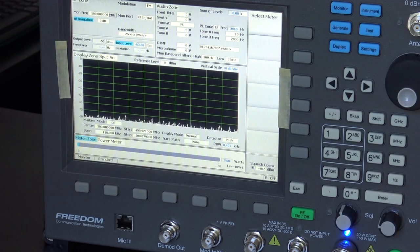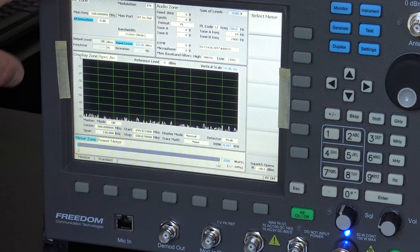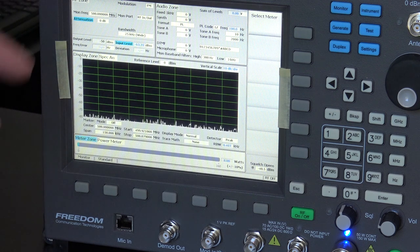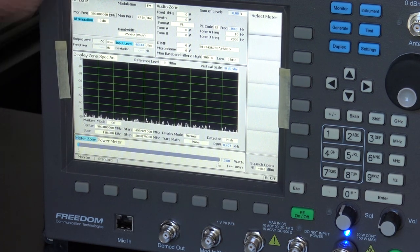That's into the dummy load built into the service monitor — you can transmit up to 150 watts across a wide frequency range. It's reading 3.17, 3.2 watts. So it's not a five-watt radio. A lot of times the numbers are over-exaggerated, but it is about three watts. You're only going to do plus or minus maybe 0.1 to 0.2 watts difference with a cable versus the HT antenna on top.